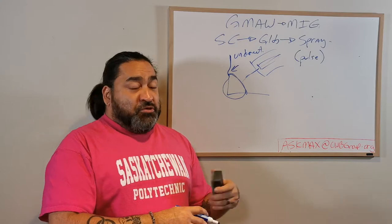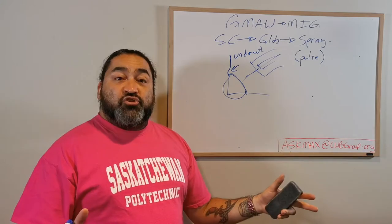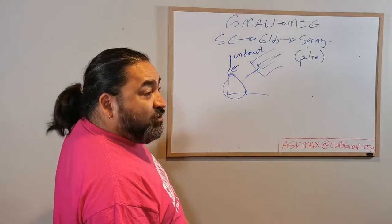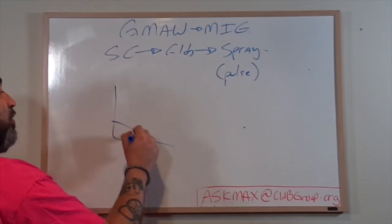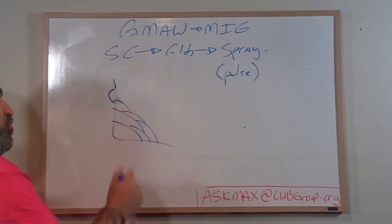It can be an NCR, it can be non-compliance, it could be a repair, it could be a fail, depending on the type of procedure you're welding to. So very often in spray welding, you'll have problems with undercut, especially if you're looking at thicker plates and multi-pass welding. As the heat gets up, the undercut gets worse and worse.